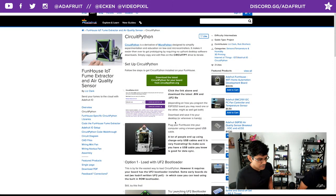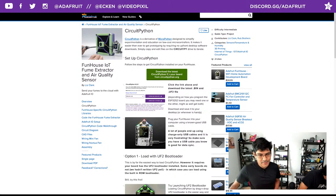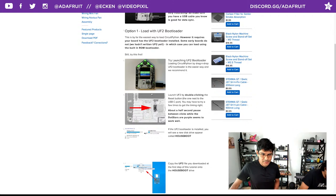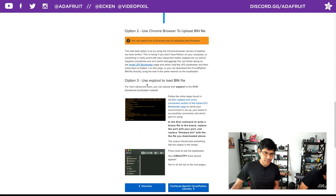All right, since it's a CircuitPython project, it makes sense to have pages dedicated to documenting how to install CircuitPython on your board. So this is the ESP32-S2. You can download the UF2 of the latest version of CircuitPython by heading over to CircuitPython.org. All this is nicely documented, and these are mirrored pages from our Funhouse Learn Guide. So it just walks you through it, and even walks you through the thorough stuff if you have some of the earlier boards with no bootloader. But chances are that yours is ready to go.